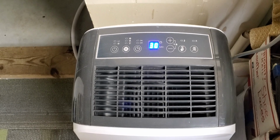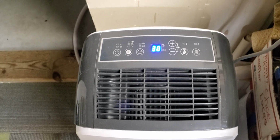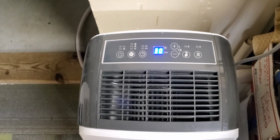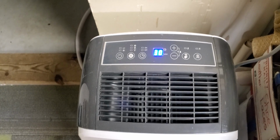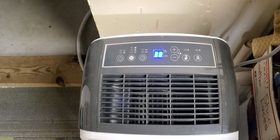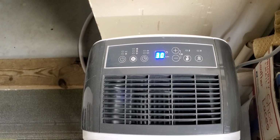I do control the humidity in my shop, but even so, in the summertime when the humidity rises, the wood that those miter sleds are made out of, the runners, is going to expand with humidity. Then they might not fit so well in those 18 millimeter slots. And here's what we can do about it.